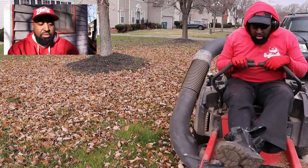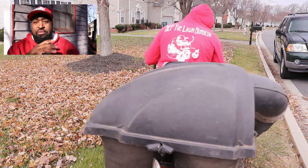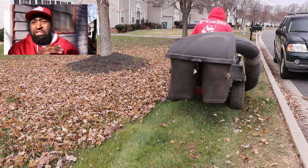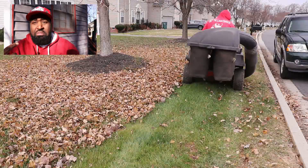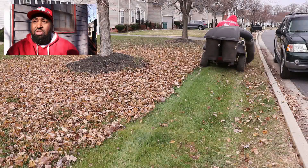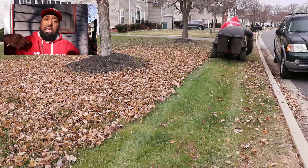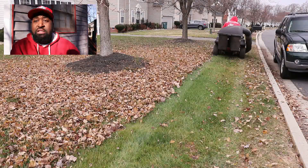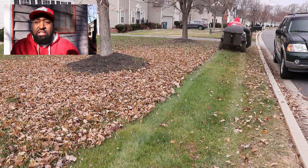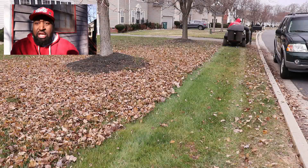It's just like you see me here using my bagging system. First thing I want you to note is how slow I'm going. What you have to realize is that residential equipment doesn't come with the extra mulching blade or motor that's on a side chute. That motor not only shreds up the leaves a second time after the blades have shredded them, it also helps blow them up the tube into the bag so the tube won't get clogged. With the residential bagging system, it doesn't have that, so if you go too fast and try to stuff too many leaves in, it'll get clogged. Best to take your time and go very slow.